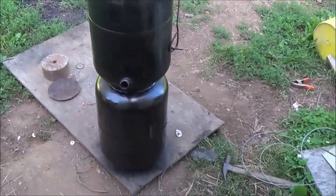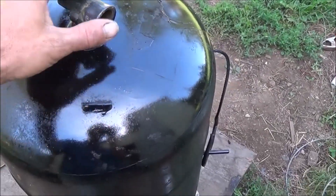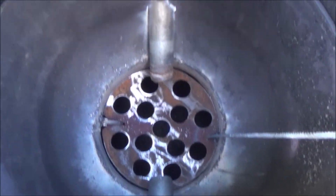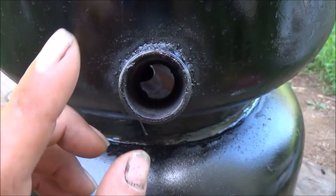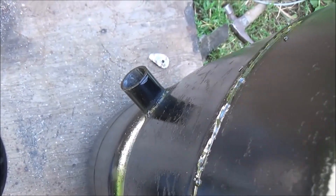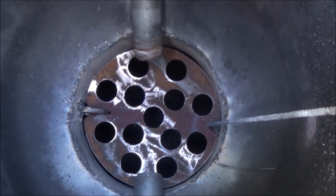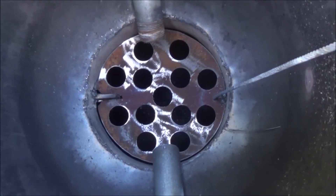I've put a coat of paint on it so my hands don't get quite so dirty. I've also got the other top that was from our other gasifier project back there. I used the other propane top as our lid. You can see down inside of our gasifier now. You can see our air inlet pipes there facing right towards the center. For our air inlets this time, instead of doing eight half-inch round holes, what we've done is two one-inch round holes. We've got a one-inch pipe six inches long going down in there and right opposite that there's the other six-inch piece of one-inch pipe. They both protrude just slightly out over the edge of the reduction zone, extending out towards the middle, and that allows us a more direct burn right down the center of the column.